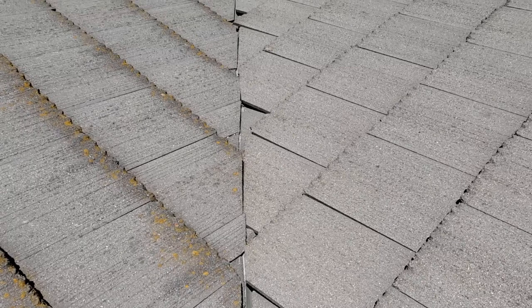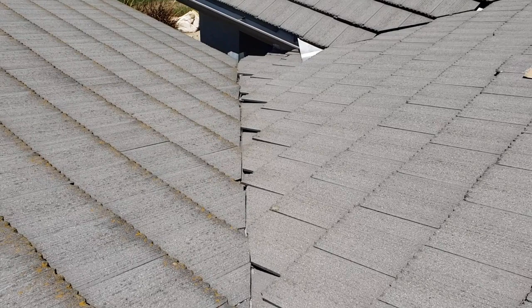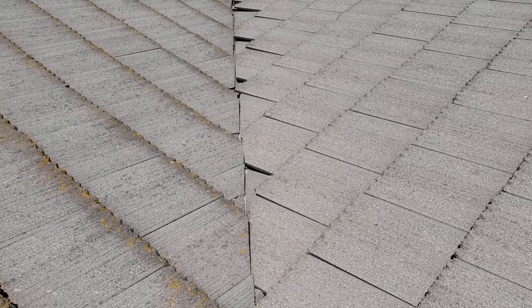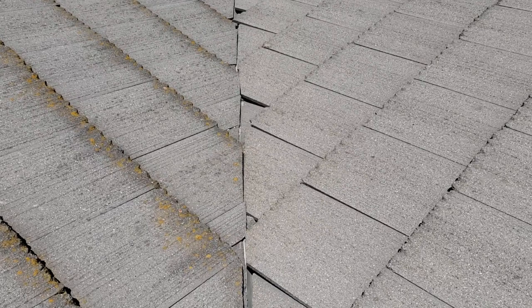Filming a valley right here. This valley is leaking — not only into the garage wall and coming out the window seal, but down where the fascia board is leaking as well. Typically when that happens, it has to do with how tight they've put the tile together and debris has dammed up, water travels sideways off the metal, and burns holes in the paper. I'm going to start taking it apart, find out where the leak is coming from, and then get the camera back on it.